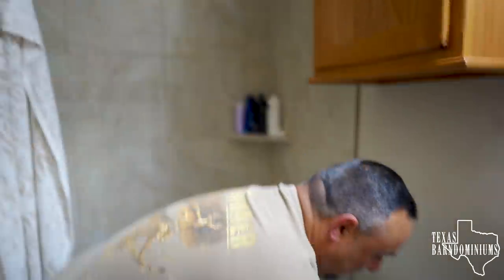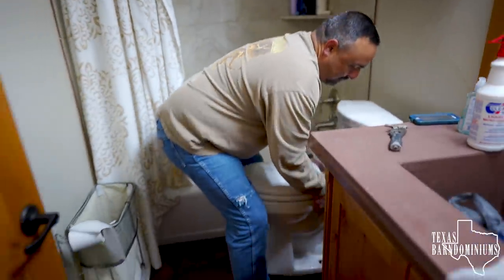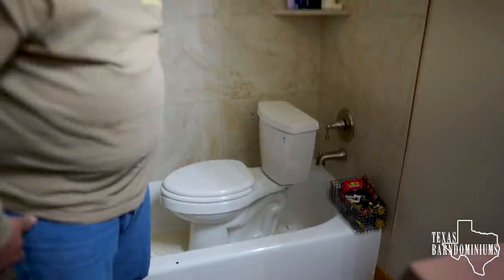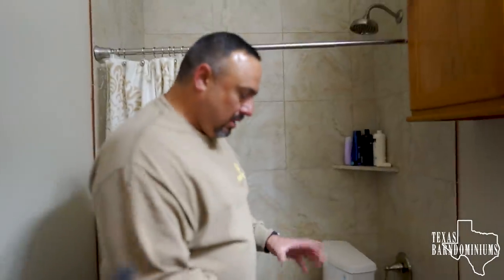So now all you do is lift up on the toilet. It should come up pretty easy. And this is the fun part. So now I'm gonna clean all this up, get the new wax ring, put the wax ring on, get the new toilet, and we're gonna show you how to install that.